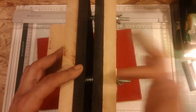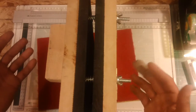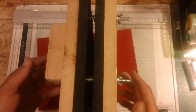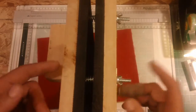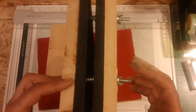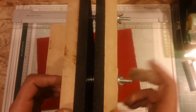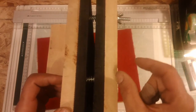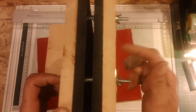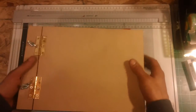The MDF is actually three-quarters of an inch, so if you countersink a quarter of an inch it should be a good enough pocket for the spring to stay put, and the quarter-20 screw rides in that spring. As far as hardware — if you have an Ace Hardware nearby, they have a lot of specific screws for all kinds of little projects. I got my four-inch screws there, and they have a drawer with a bunch of different springs. The spring I got was a three-inch spring on a four-inch screw. I squished it down to about an inch and a half with my finger — you don't want too stiff a spring or you'll never be able to collapse this properly.